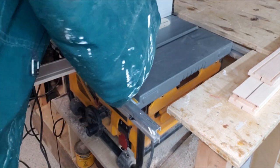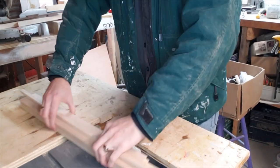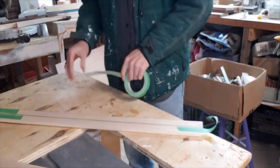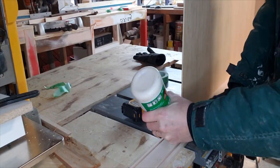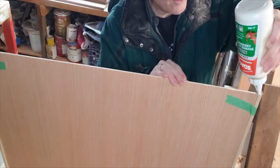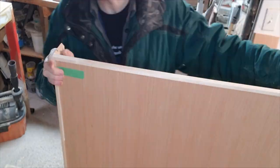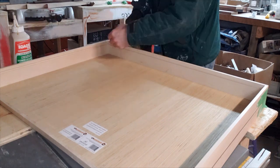For the front piece I need to cut it into a few pieces so that I have space for the drawers. For the original glue-up I rip-cut the bottom groove off the front piece and set the rest aside for later use. I'm going to assemble these using green painter's tape to make hinges between each of the adjoining pieces, then add some glue and fold everything together.